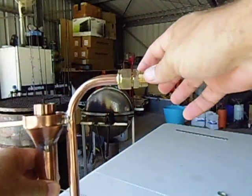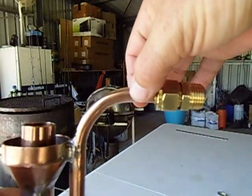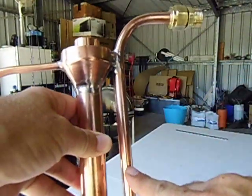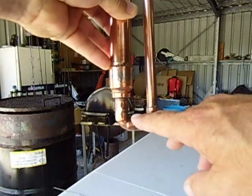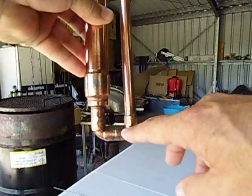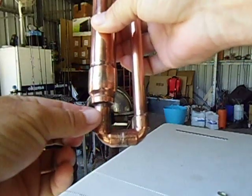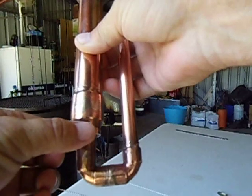This is the part that goes onto my condenser. It just fits onto the half inch or 12.7mm tubing, which is this one here that runs down to the bottom. It's got two 90 degree elbows that are joined together with silver solder, and also this joint here. Then I've got a reducer here that's 12.7mm that runs into 25mm.